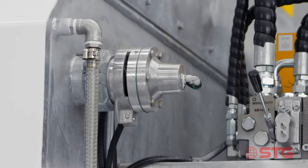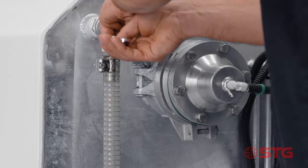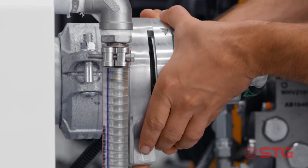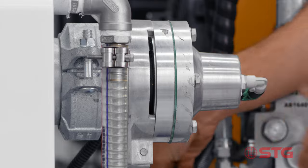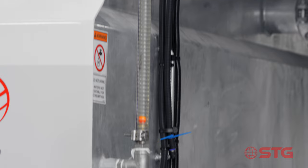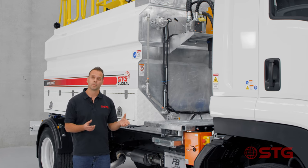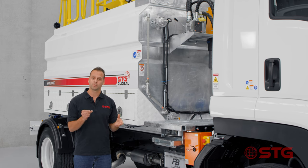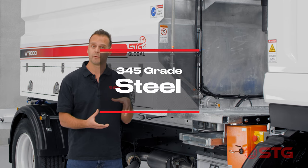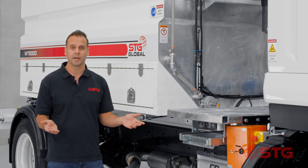All our trucks come standard with side batter sprays. They're connected to roll groove fittings, which means you can take the fitting off and change the pattern of the spray. All of our pipework is internal - not only is this visually appealing but it creates much greater structural integrity within the tank. Anywhere there's a penetration we've doubled it with two 6mm sections, giving you 12mm of 345 grade steel that is then hot dip galvanised. These are the reasons why the STG tanks just can't be beaten.